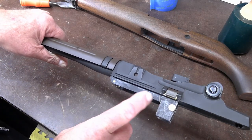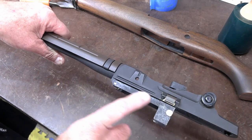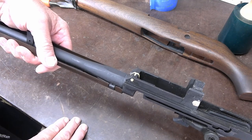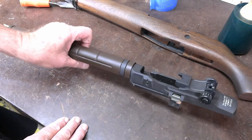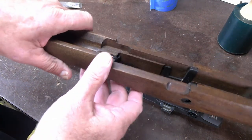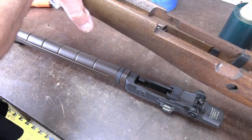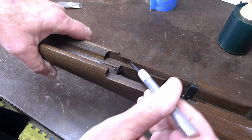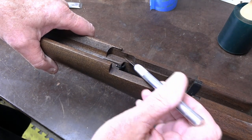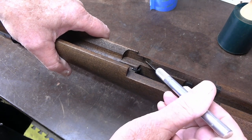This will reduce and eliminate by glass bedding at these junction points at this side plane on both sides. That's going to eliminate all the errors that are induced by that wiggle. So those mating surfaces are very simply found along this side right here. We don't have to go all the way up forward here. This is really not necessary. This is just a clearance area. You don't have to bed those areas.